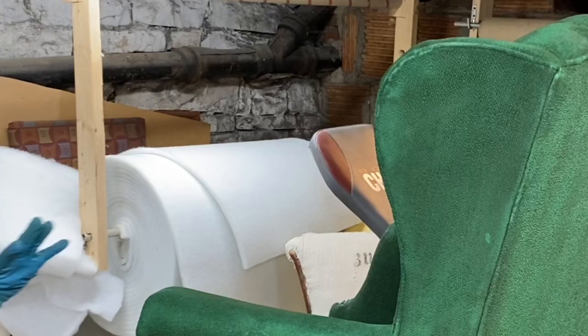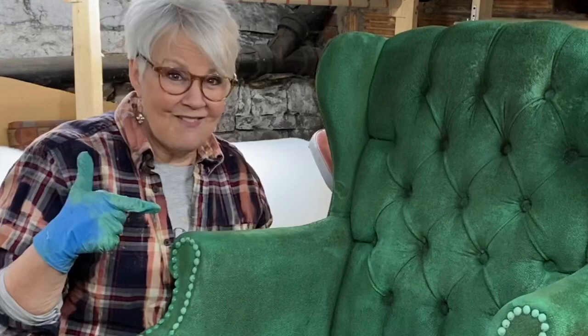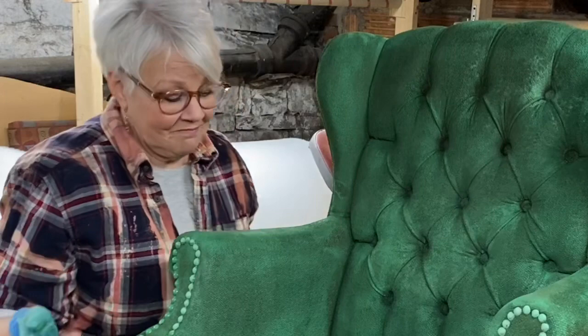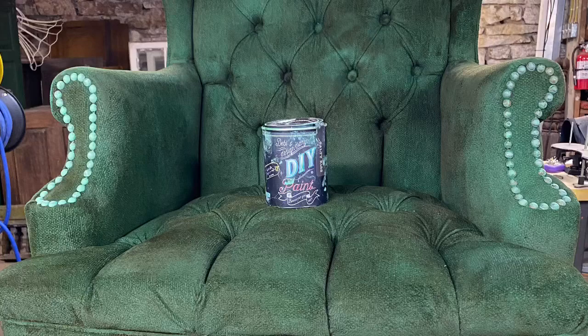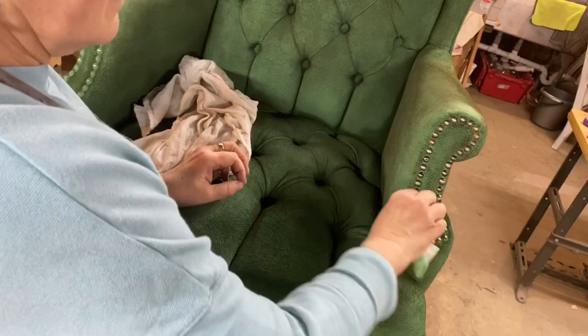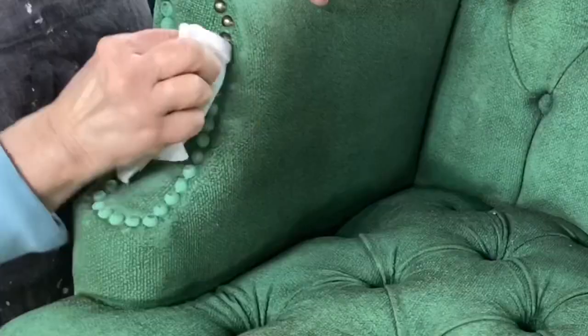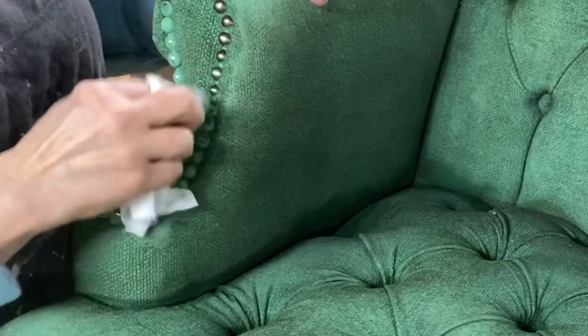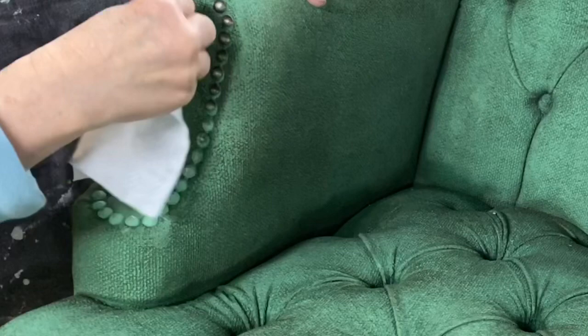I have applied my fourth coat of watered-down Salty Kiss to this brown chair. I'm kind of loving the way it's turning out — is it perfect? Probably not, but I'm good with it. We'll let it dry overnight and put a finish on it tomorrow. One of the things I really love about Debbie's DIY clay and chalk-based paint is that it's water soluble and has a really long open time. Even after the paint has completely dried, you can come back with a wet cloth and remove paint from areas to reveal the layers underneath. I didn't have to remove all of those brass nail heads — I could just wipe the dried paint away with a wet cloth to reveal them.